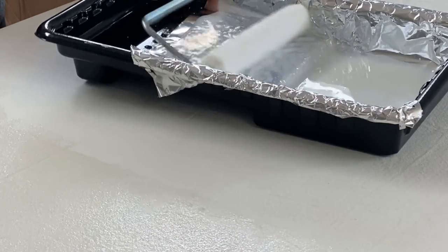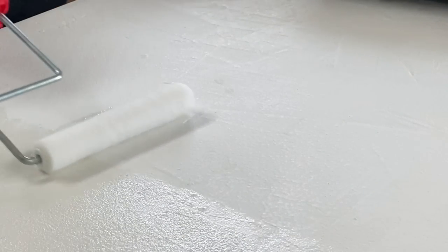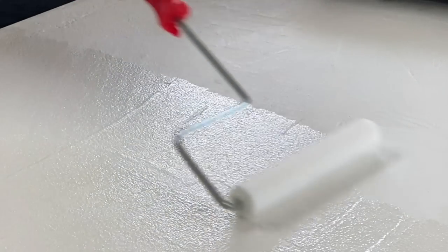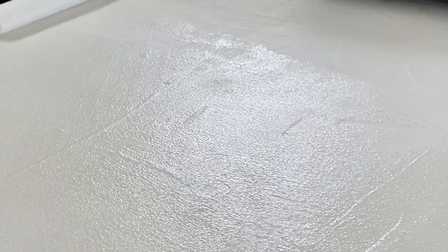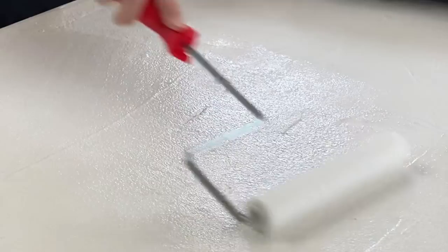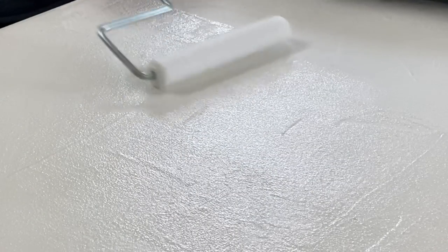Okay, everything's looking really good. I lightly sanded and now it's time to seal. I made the mistake of going with a sealer that was not an acrylic clear sealer, water-based sealer, and it actually turned the entire countertop a little bit yellow. And so I had to do another skim coat, let that dry, got a new sealer, and now this is the new sealer, which is a lot prettier. It has a more white tint to it, and it definitely didn't alter the white concrete in any way. We didn't want that yellow, dirty looking color.